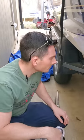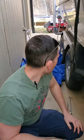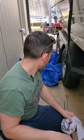I didn't film taking it out, but I am going to give you guys some step-by-step to get it back in. Taking it out is just the reverse. This is almost always the problem with the steering, is these cables. It's usually not anything to do with the power steering. As long as your fluid's good and you're holding a good level in the reservoir, and you don't see any leaks, then I wouldn't worry about the power steering pump at all. All right, let's get these in there and we'll keep going.